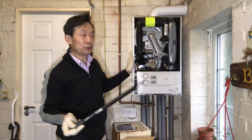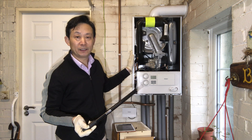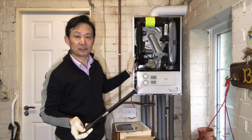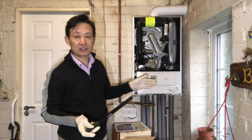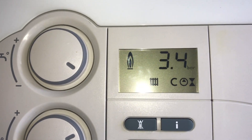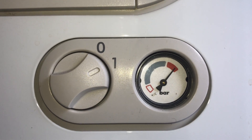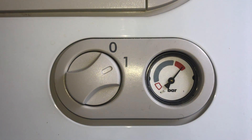But at the end of the day, you will need to do the annual safety check, because safety is very important for you and your family. Do not do DIY on the gas yourself. Make sure safety is your priority. However, for temporary measures, you can make some diagnosis and repairs to ensure small issues will not prevent you from using your hot water and central heating system. After topping up the water, when the heater is on, check the meter. If the water pressure is too high, you need to release some water from the central heating system until this meter comes back to the green zone.